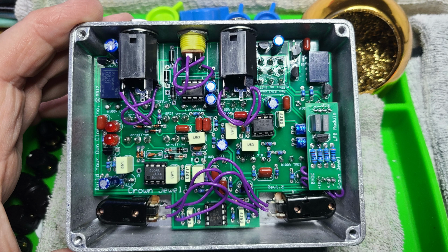So, I got in there, moved the potentiometers while they were still soldered, clipped the leads, and then put painter's tape on the backside of the potentiometers so that if they were to touch anything again, they would not ground out. And lo and behold, plugged everything in, it worked.